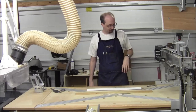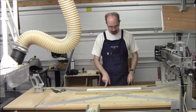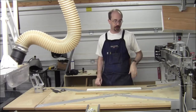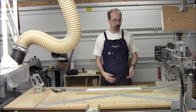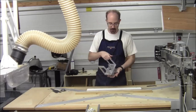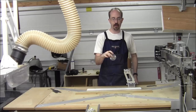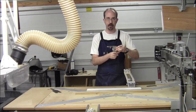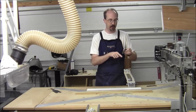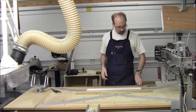What I did off camera earlier today was I took the machine and had it drill a couple of quarter-inch diameter holes along this edge. They're literally at zero travel in this direction toward me — as near to me as the machine itself can get. I did that because for other fixturing or for doing a wider or a batch job, I wanted to have the most amount of available space. Because this sits on the machine and the axis is essentially limited to that as well, and you've got a two-and-three-quarter-inch diameter blade — these holes are allowing me to align.